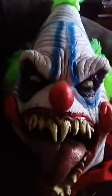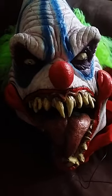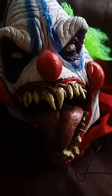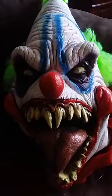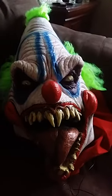The third thing I wanted to do was have some LED eyes. I went through my box of LEDs and originally wanted green because that kind of matched everything, but the greens weren't bright and piercing, and I didn't want to go lasers because you're going to laser someone's eyeball. So instead I've got some very bright blue LEDs in the eyes. That's two wires going down, and then I've got a 9 volt connector soldered on so I have it to the 9 volt battery, and a momentary toggle switch which I can press like that and it lights up the eyes. So you make contact with someone — hey, how are you doing? And that's my modifications to the Big Top Clown Mask.